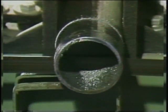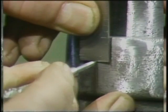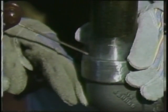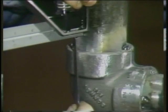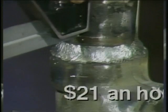Time to make a true square cut. Time to measure and scribe. Time to pull out and scribe again. Tack. Time to check the level to make sure the pipe is plumb to the fitting. Plus added inspection time to verify the gapped distance. But when the welder or pipe fitter is making as much as $21 an hour, all that time costs money.